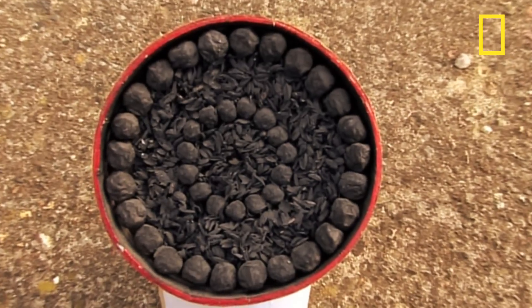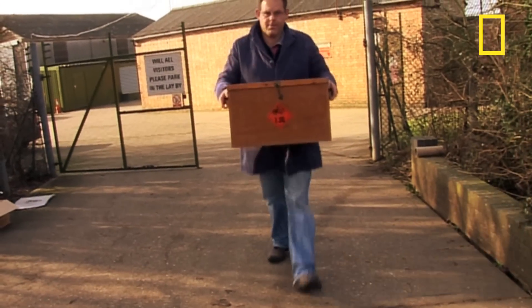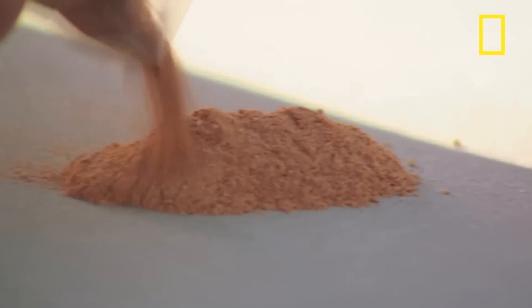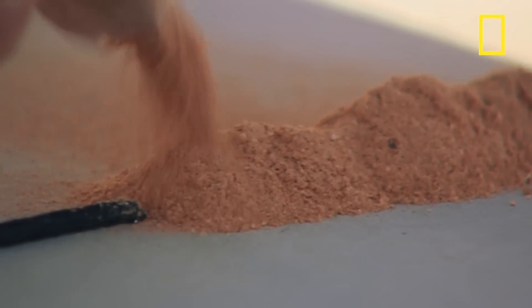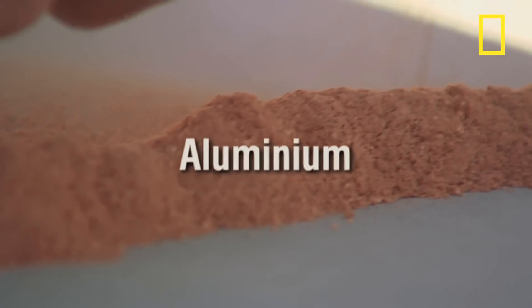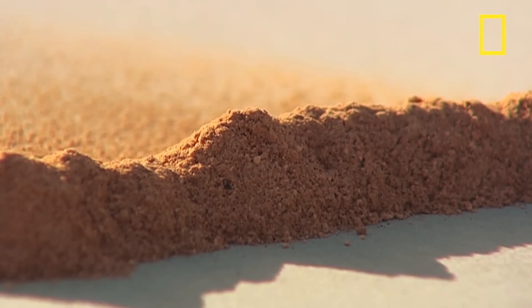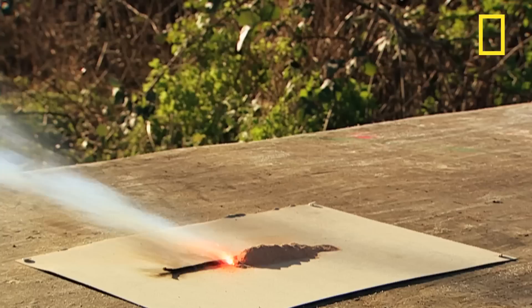As you can see, it's much more than a ball of loose powder, and this is how they test the component parts. The basic firework recipe is flash powder, a potent form of gunpowder. It's a mixture of potassium perchlorate and aluminium. These ingredients are mixed together in seven kilo batches, and a small sample is ignited to make sure it has the requisite brightness.